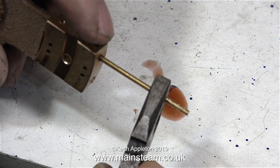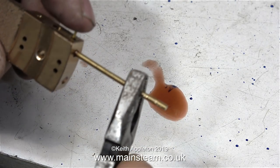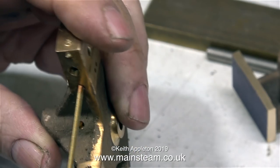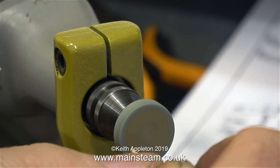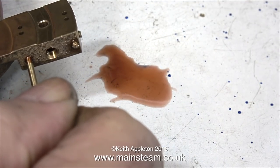Using some Loctite 542 to seal the brass rod, the rod is screwed into the pre-threaded hole in the top of the standard until it nips the pin. When you feel it nip the pin, back off the threaded rod until you can withdraw the pin — that way you know the ports aren't blocked. Then when you put the rod in from the side, again with some Loctite 542, you can just screw the rod up against the original rod that went in from the top. And once again, as I chop off each piece of rod, I reprofile the end using my Proxxon grinder.